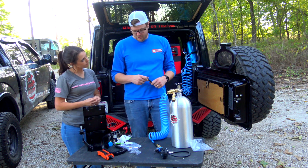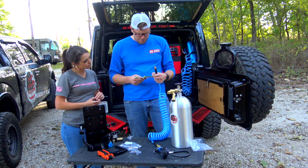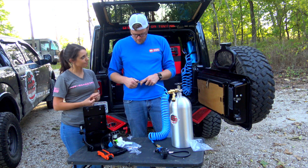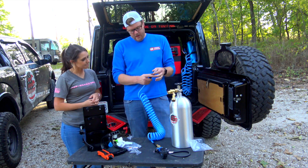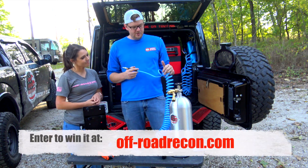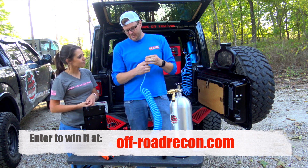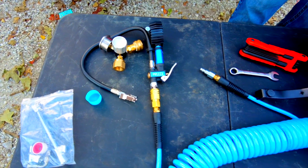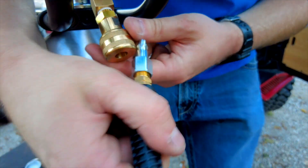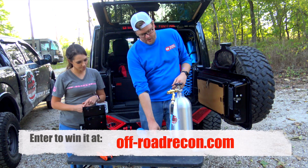The quality of the hose is really good. The PSI rating on it is like 250 PSI — it's a 20-foot braided blue coil hose with swivel 250 PSI quick connect couplers. Whoever wins this Priest Precision CO2 tank, make sure you take these fittings apart and put Teflon tape on them. We'll give you this little bag of parts with it so you can do that. Once you get that together, it'll snap right in there and you've got your tank hooked up and set up.